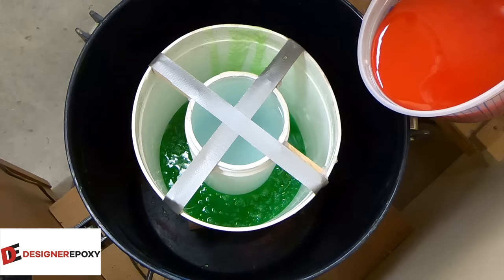If you remember, when I put that birch piece on the very top of this, I didn't use a lot of glue to hold it on, and I was a little worried about the vase breaking free while working on the bottom tenon. So that's why, after I remove the tailstock, you don't see me do any turning. Just chisel away that nub and then grind it away with the drill.